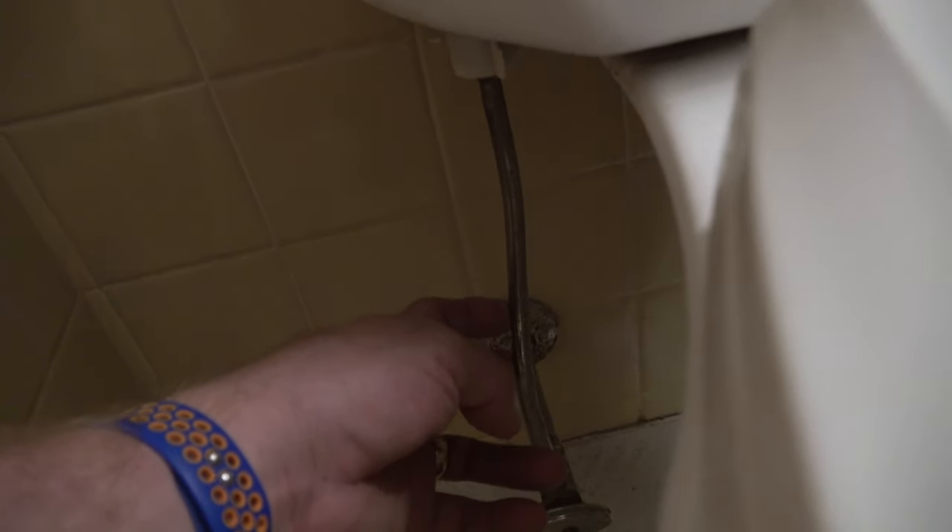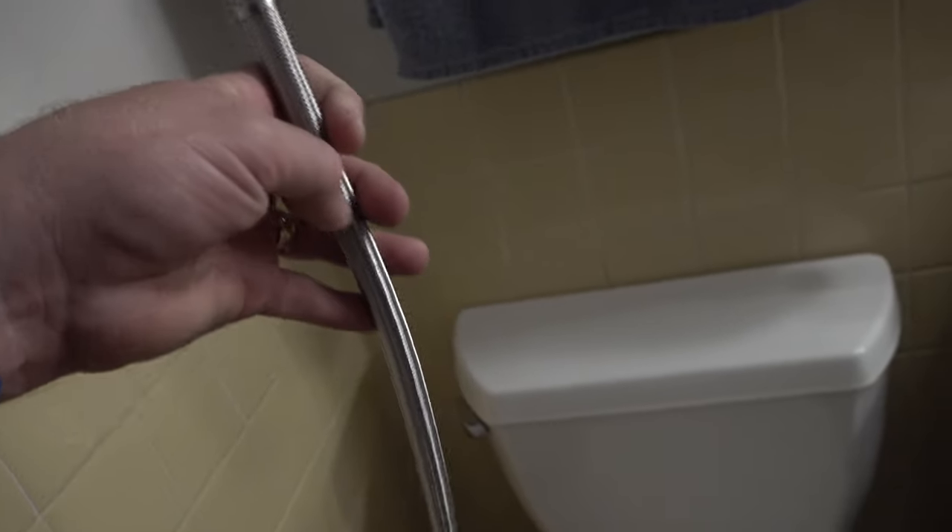Now we're going to disconnect the water. Usually what you have down here is a shut-off valve — I'm going to go ahead and shut this off. We need to drain the tank because we have to disconnect the supply line. I have a solid pipe here; you may not — you may already have a stainless steel flexible line. If you already have a flexible line like this, you're good and won't need to replace it. I'm hoping the threading matches what I have; I may need an adapter.